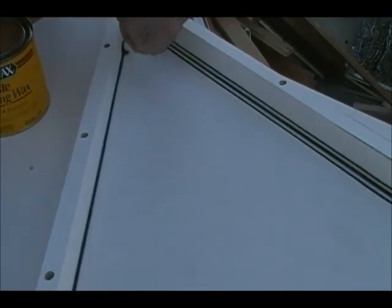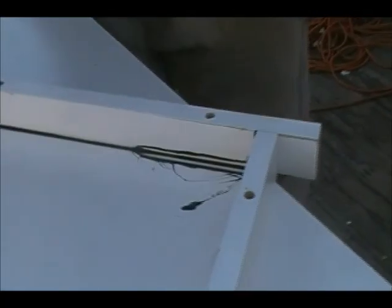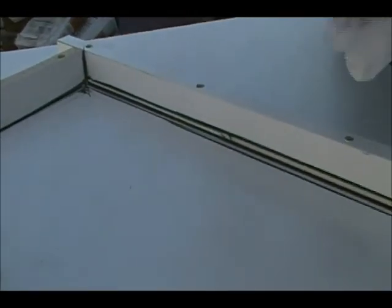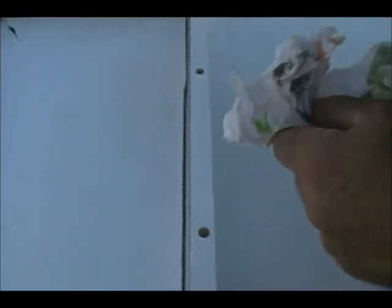That's actually the top lip of the concrete with the butcher's wax there — this silicone sticks to it and I should be able to peel it off. I've watched a bunch of guys doing it; some guys use regular white acrylic latex caulk, some guys use the silicone — I kind of like the silicone. That's just my preference. You have to be a little neat with this — I know I'm gonna get pinholes and air bubbles, and I am gonna try to put a vibratory sander on here to get the grout to actually flow and do its thing.